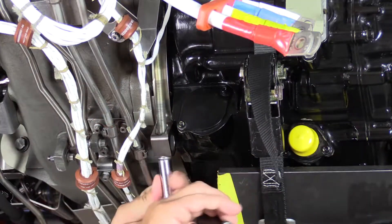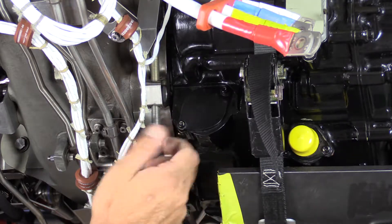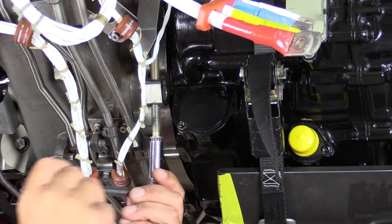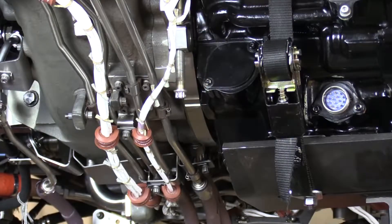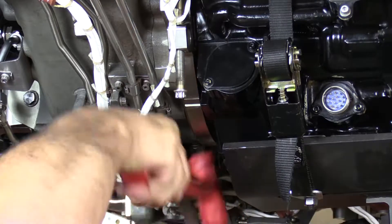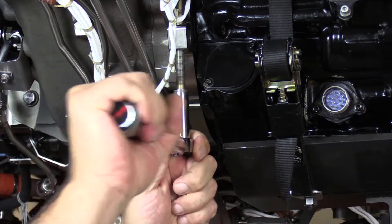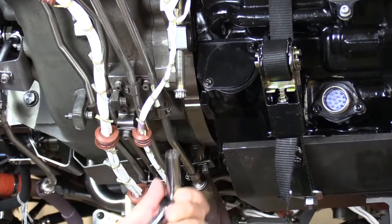Now we can begin to snug our quad ring bolts. Sometimes as you begin to tighten the quad bolt, you'll get a couple turns and then run into resistance — that means the IDG is not in perfect alignment in one area or another and is slightly out of alignment with the quad ring. So just adjust accordingly and try the quad bolt again. As you apply the final torque to the quad bolt, it's very important to remember to follow the AMM instructions to tap it in a few places as you go. Typically you'll find that as you recheck the torque, it will have gone down a bit. Do that several times until you can apply the specified final torque and the tapping no longer has an effect.